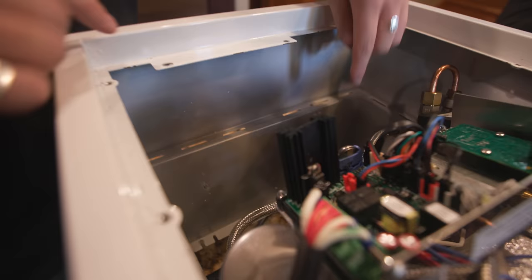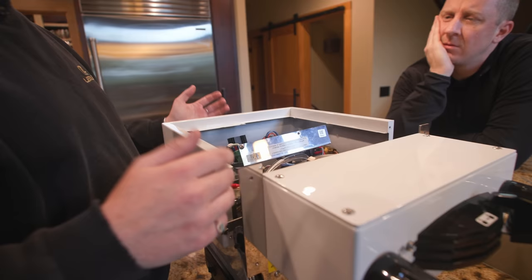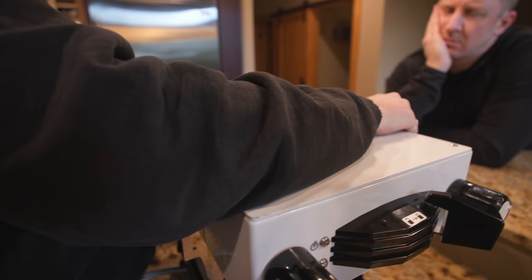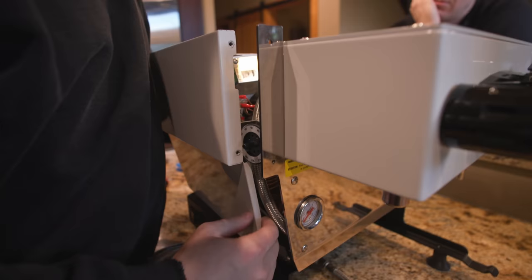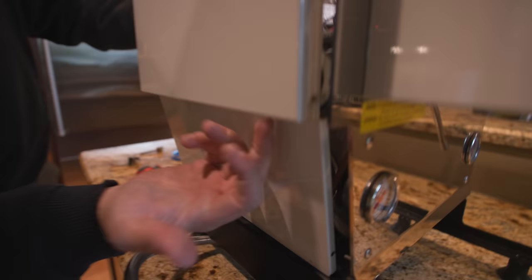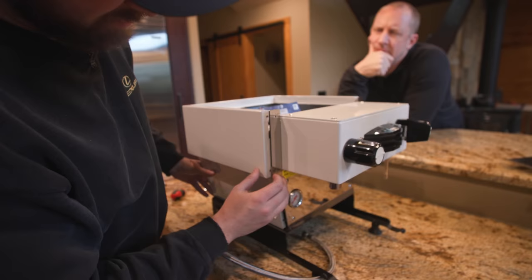For those doing this at home — you can see these two Phillips screws way down there. Those are going to be tightened down and hold this case. Having done this many times, I just keep them loose because the case comes off every now and then. There's a little slot right here — if you look down low, this is where the wheel sets for the boiler temperature. For a unit like this that many people might have their hands on, I'd probably keep it tucked away so people don't adjust settings they don't mean to.